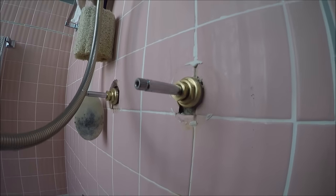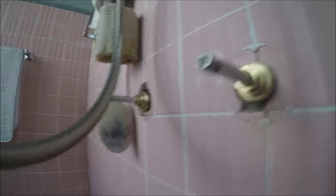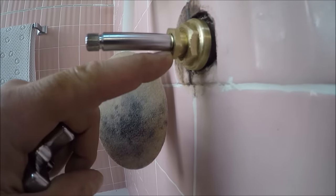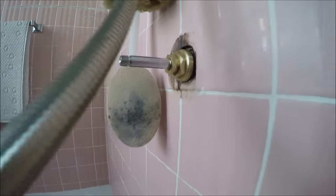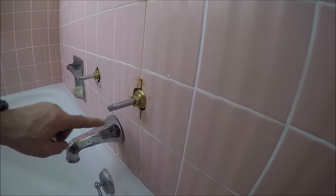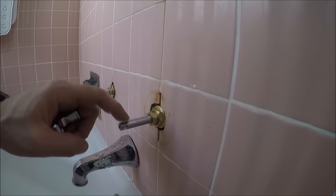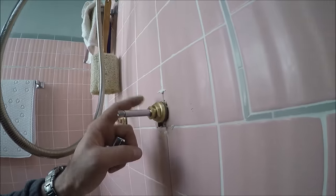As you can see, they will drip right out at the stem or they'll drip out right at the threads where this goes in here. I also adjusted the bottom ones. The bottom ones don't hold as much pressure because it's not squirting out — it's just a free flow coming out here. So you don't have to tighten these packing nuts as much as you do the shower head.